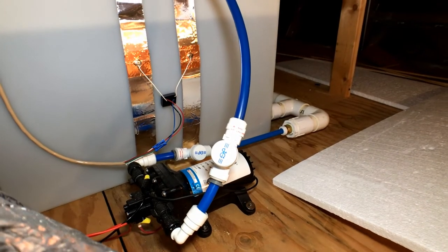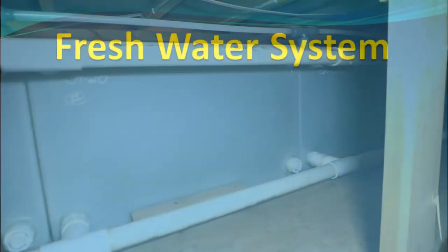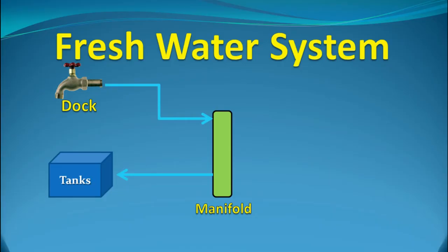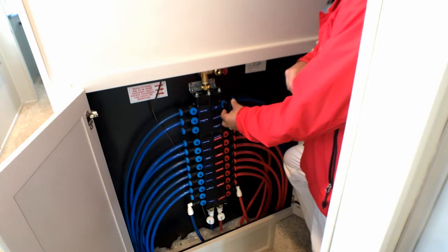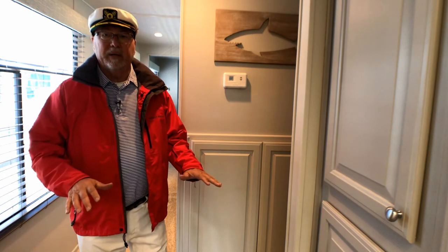The fresh water tanks are located below deck for two reasons. One is that it makes more sense to have the water stored close to where most of the plumbing is located. The other is concerned with potential ballast. All the tanks are connected together and filled together. The tanks are filled by turning on the valve at the manifold, assuming the dock water supply is on. Once filled, the excess water will come out the overflow and be directed overboard. At about nine pounds per gallon, our four water tanks when filled weigh about one and a half tons, keeping the center of gravity lower and making the boat more stable.